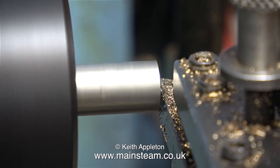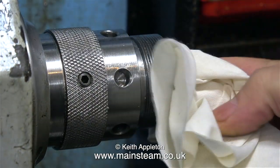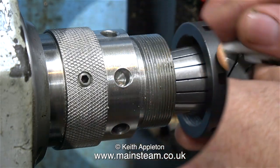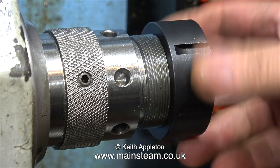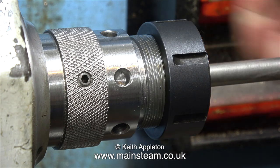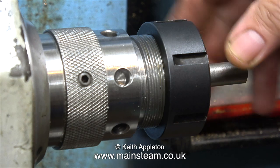So what's going on here? The thread in the chuck that fits onto the spindle nose is an absolutely perfect fit — it's nearly an interference fit. Just in case I have some metal particles in the chuck and on the collet, I'm giving everything a good clean. Here I'm fitting the collet with the locking ring. The thread on the end of the chuck is perfect, and the thread in the locking ring has a bit of tolerance, but it really doesn't matter — its only purpose is to hold the collet into the taper.